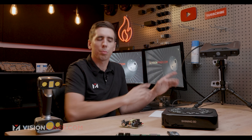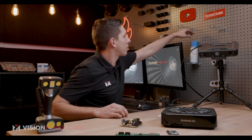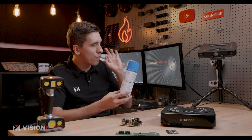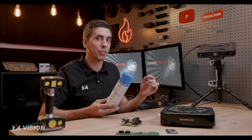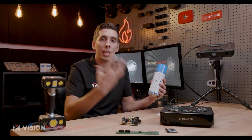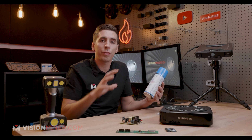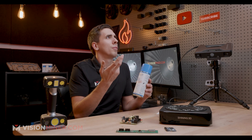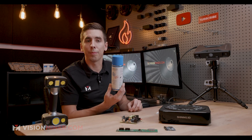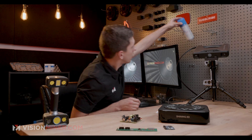The HX — I can actually use the laser mode and get very, very fine detail. It'll just take a little bit longer and gives the ability to do much bigger parts more easily with better tracking. But if all I'm doing is circuit boards and small parts, then the Pro HD is going to save me time, and time is money. So this is my main pick, but we'll do a little shootout to see how they really do. Just a moment on the spray — we've got AE-Sub, available at visionminer.com. It's a vanishing spray that leaves next to no residue; there are scientific papers on how little residue it leaves. It's basically like spray paint — it coats the object in a light color to reflect light for structured light scanners and makes it really easy for the scanner to pick up all the features. There's a white cap, orange cap, and blue cap — they're all white spray, just different durations. The blue is two to four hours, the orange is 12 to 24 hours, and the white is actually permanent but can be washed off.